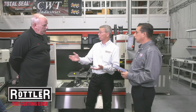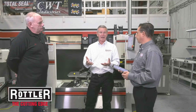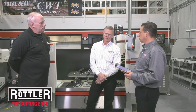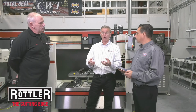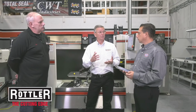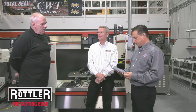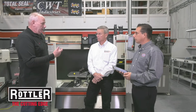I have several customers that maybe use, I've heard of Pam, believe it or not, the cooking spray. But they claim that the Pam, because it has a temperature resistance, really helps when you're machining. There's a liquid out there called Cool Cut that seems to work very well, that comes highly recommended. It's pretty expensive per gallon, but you just use a little bit of it and wipe it on that aluminum surface right before you cut. You don't really spray it on. It's just kind of a wipe on because it's pretty expensive. Interesting. But it sounds like a trick of the trade and a personal preference depending on who you're talking to. Exactly. Absolutely. One key is keeping the cutter bit sharp. Keep it rotated. Keep it into a sharp point, and then you have less chance of it dragging the aluminum across there.